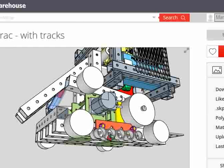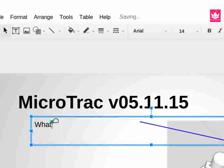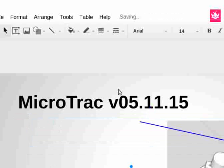Even if we don't like the three idlers, it should just be a matter of popping that off and putting this on. If we've got the three idlers and none of these tiny idlers, the tiny idlers would also introduce some complexities, depending on, once again, we haven't drawn up the track. So the suggestion would be just do one idler in the middle. Let me just put that in. Do one idler instead of many idlers.